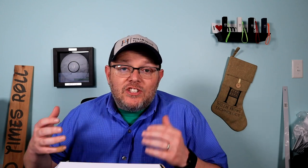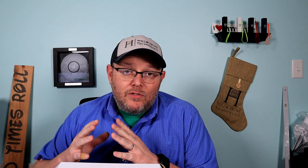What we're going to talk about tonight is the Grandstream GDS 3710. I'm going to show you how we wire it up, and then we're going to log into the device and take a quick look at it. It's an HD video door system that can be used in conjunction with electronic strikes to let people in and out of doors. You can use it as a time clock, a video doorbell, or a punch-in-punch-out system. The uses for this are vast. The camera inside of it is ONVIF compliant, so you can use this with any NVR — it doesn't have to be a specific manufacturer. Anything that is ONVIF compatible can use this, so your options open way up.